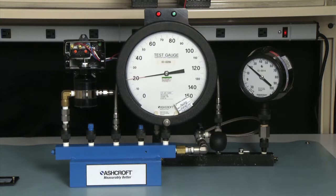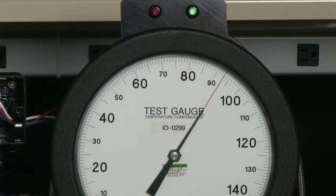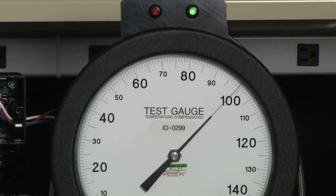So that will now be 80 plus 20, the static pressure. Our test gauge will be set for a pressure of 100, but that is 80 psi D. So we will bring the gauge pressure up to 100. As you can see, the switch has already turned on, but that is okay. We are going to cause the switch to turn off and then turn back on again at that set point.